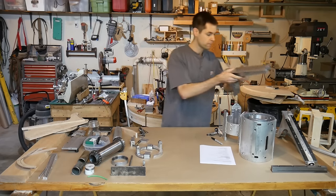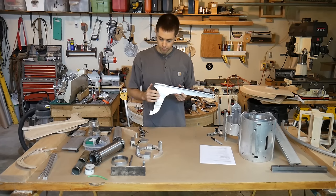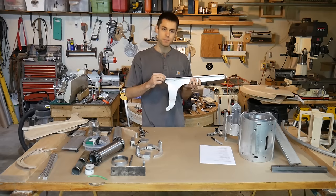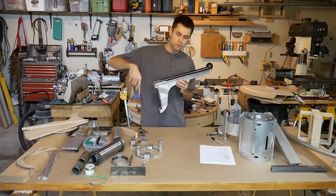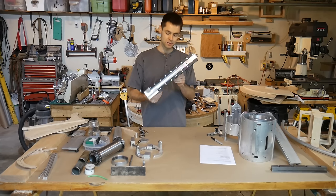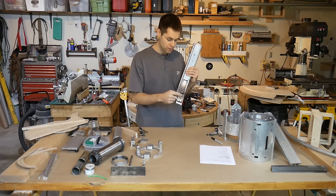This is the original strategy. These are the arms that you saw in the actual working one. This is not the final version — it gets simplified even further. What I ended up doing to account for distortion, after I got the welding more or less under control, was to have a 5/16th piece on the top and then mount it up in a jig — which became also very time consuming — fly cut the top, and mill the tracks down the side. There's a lot of time that went into these. I didn't want to have exposed weld, so I welded these on the inside, bent the pieces around, and then tried to weld those.